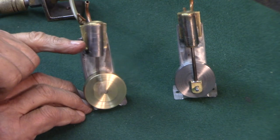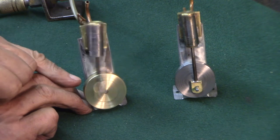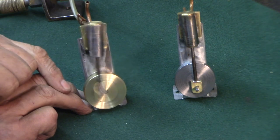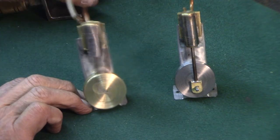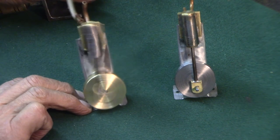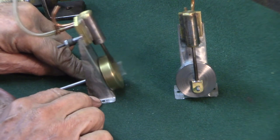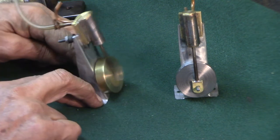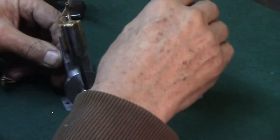So this is the smaller bore — the piston is a better fit though. It's slightly over 3/8ths, like 0.378 instead of 0.375. The stroke is a half inch, so 3/8ths bore, half-inch stroke. It runs good. Hasn't been broken in yet, really. That's number two — let's try number one.